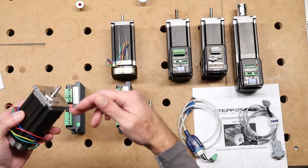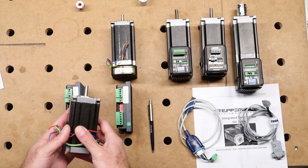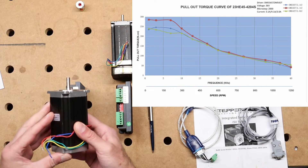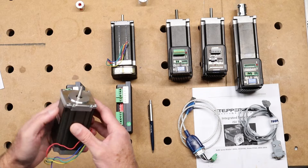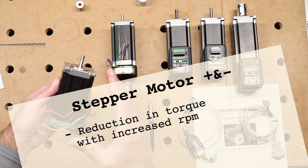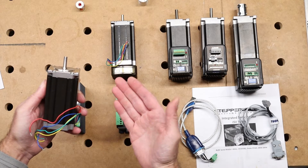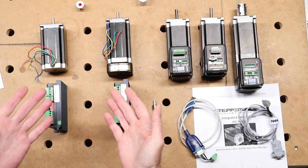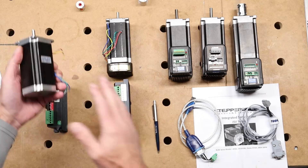The rapidly falling torque with higher RPMs is one of the major drawbacks of a stepper motor. The values here: you have half the torque left at about 500 RPM, and only 10% of the torque left at about 1500 RPM. The stepper motor has a drastic drawback when it comes to useful RPM range — it just doesn't develop any torque at higher RPMs. So here's a quick calculation of how many RPMs you really need to drive your axis if you only have half the torque left at 500 RPM.